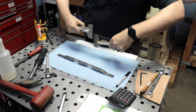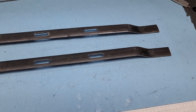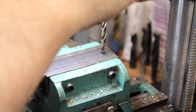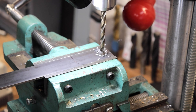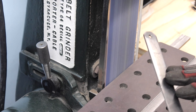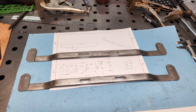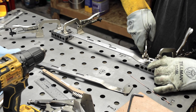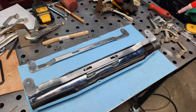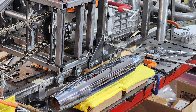Each bracket would next have a small outward bend to hold the muffler about an inch off the frame — done by hand with sheet metal benders. They also hang about an inch below the frame, so they needed small vertical pieces. I marked these out, drilled the mounting bolt holes, and cut and shaped the ends with my new-to-me tool: a used hardcore high-power belt sander. I welded one to each end of each bracket. The muffler mount brackets fit onto the back of the mufflers, bolted through the small slots. A fit test against the frame looks pretty good.